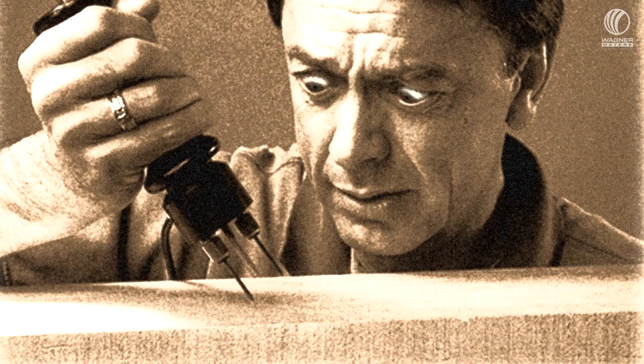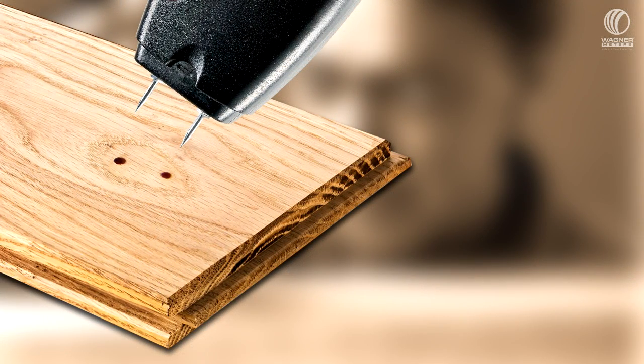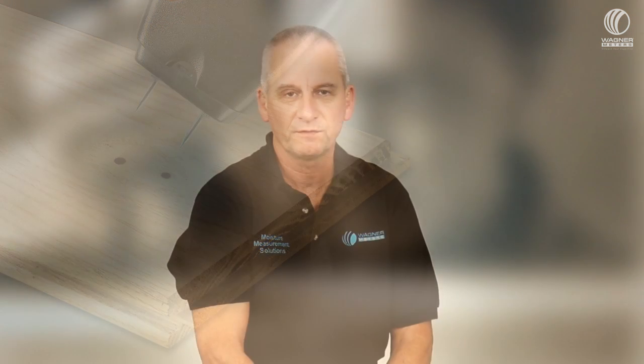Now, there are two basic types of technology in handheld moisture meters for measuring the moisture content in your wood. These two different technologies are vastly different. The first one is pin-type technology, where you actually poke holes in the wood with two sharp probe pin-type devices in a meter, and you're just measuring the resistance between those two pins. The resistance varies depending on the moisture content.